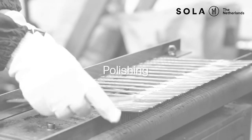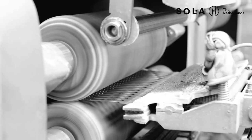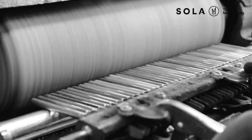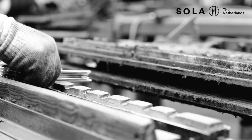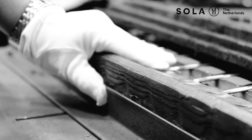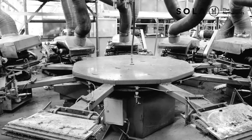The following step is polishing. Polishing is more than giving the cutlery a nice shine. Our Sola factory uses fully automatic polishing carousels. Polishing paste is smeared onto a high-speed wheel, then the cutlery is pressed against the wheel, creating a lot of heat. The polishing paste does not only give the shine to the cutlery — it also closes the surface of the material. There is also a line where they use a special machine called flippers. Flippers are basically a large clamp with handles in which one dozen or more items are placed. The clamp is closed and put into a machine with a wide polishing wheel, and multiple pieces can be polished at the same time.